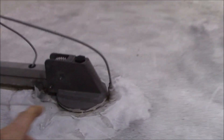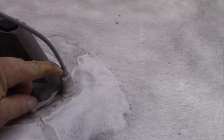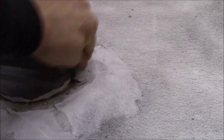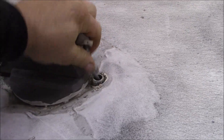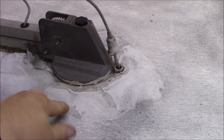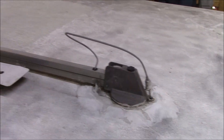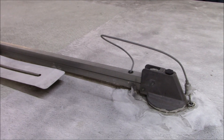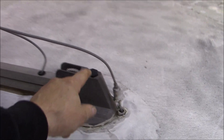This here is your antenna — a crank-up antenna. Water trickles down here and goes right through there and gets inside your coach. That's how you get water. If these work loose because you keep going up and down with them — we can't put those on. So if you're headed here for us to put a new roof on yours, we cannot reinstall this crank-up antenna.